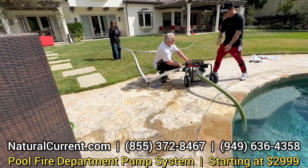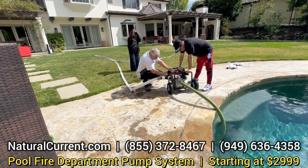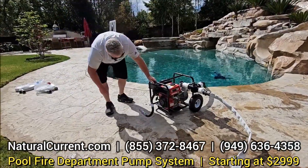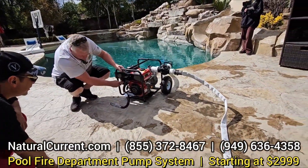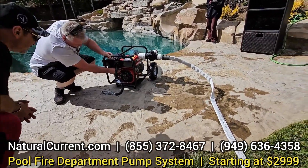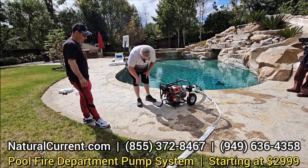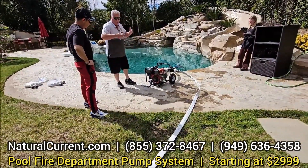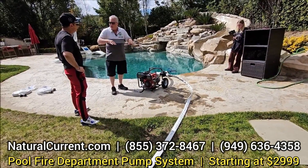You always check to make sure you have gas in it. I just put gas inside there from the bottle I showed you. Oil's in there. So what we're going to do is always turn it on first — that's always going to be your first step. Then you're going to come over here and make sure your gas is on. This is off — the gas is going to go on. And this is your choke and we're going to open the choke. Then on the throttle — see up here, you really got to kind of bend down and see — we have the throttle here and we're going to put that right in the center. So now you're good to go to fire it up. The gas is on, choke's on, throttle's in the center, we have gas in it, we know we have oil in it. So now you're bringing it out because there's a fire warning and you want to drench your property, or you're just out here testing it — giving it a go, making sure everything runs well and the hoses are all good.